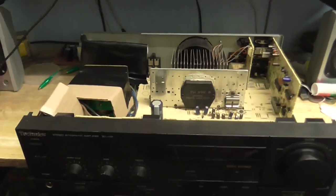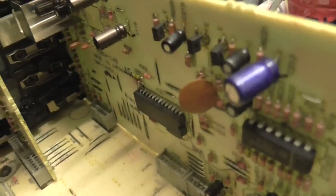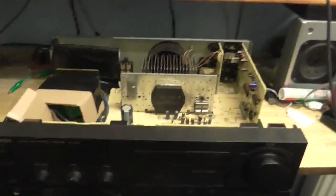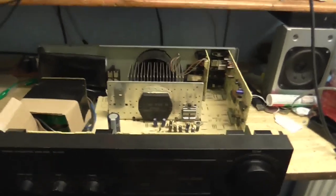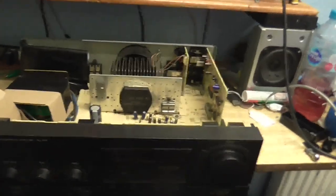So far we know all the voltages are good, the chips are getting the voltages they should be getting, and this chip appears to be getting the data it should be getting. The next thing to do is put an audio signal into this and trace that audio signal to see exactly how far it gets before it stops — although that's going to be in another video, because this one is probably already a gazillion minutes long. So until next time, goodbye. I hope you enjoyed this video. If you did, please consider giving me a big thumbs up, smash that subscribe button, and leave a comment. As always, until next time, goodbye.